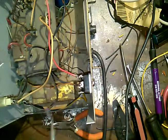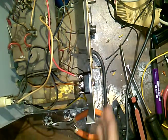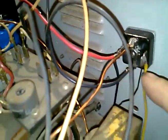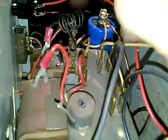Okay, so we're pretty much soldered up now. Now it's left to put the meter back in. And you can see AC coming in here and here. This is your DC positive, DC negative. It's going through a choke under the capacitor here and onto this distribution marshalling board, I guess call it, through this little load deal here, and then off to the positive side of this switch. It's not going into the switch, it's going down there to that red terminal and back up to a switch and to the meter.